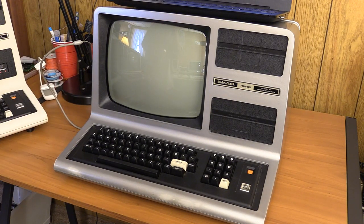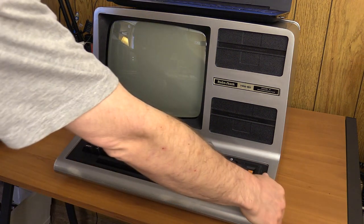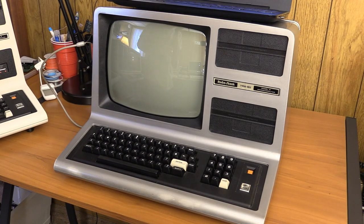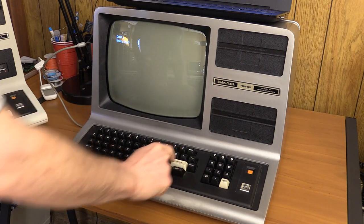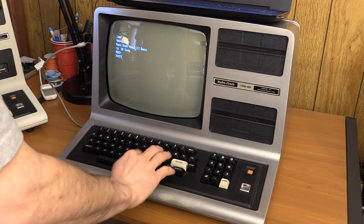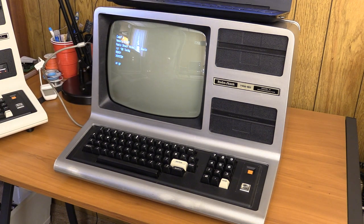Back up and ready to go. I've got my laptop sitting on top of this thing, connected to the cassette port. We're going to power this up — should still work. I have a cassette ready to go. Oh my god, it works. So since it's pre-work, we're sticking with the more appropriate beverages here. This is the system tape — I'm going to run that. The relay is a little light, so something may be wrong with that. This is a Level 2, 500 baud tape. At least the interface is working. The weak relay concerned me a bit. While this is going, as soon as this is done I'm just going to try it out — we'll make sure it works, and then we're going to wrap this video up and call the Model 3 restored.